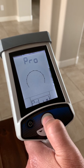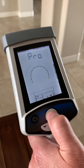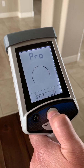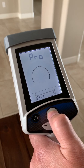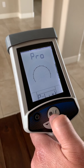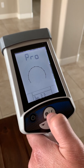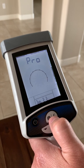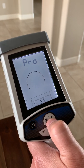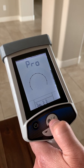P-Link is a remote connection between the receiver and the transmitter, allowing you to adjust and change frequencies on the transmitter via the receiver up to a thousand feet away line of sight. You have to order the SnapTrack with this feature, as not all units include it. Battery allows you to select a different battery type — the receiver can use lithium ion or alkaline batteries, and if you change between them, you must update the receiver so the voltage is correct.